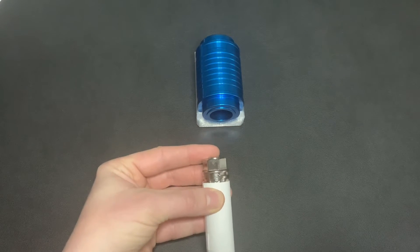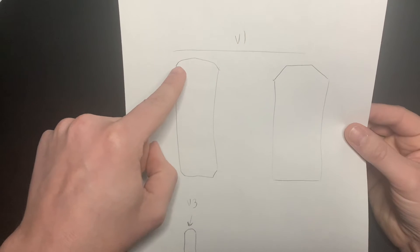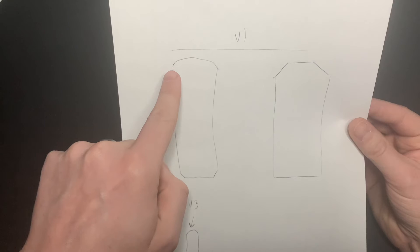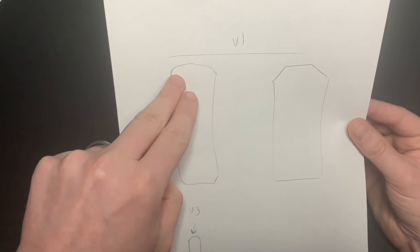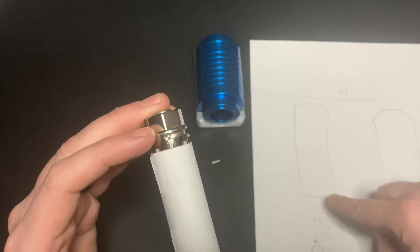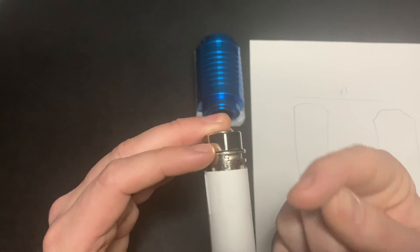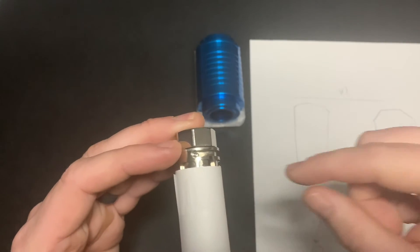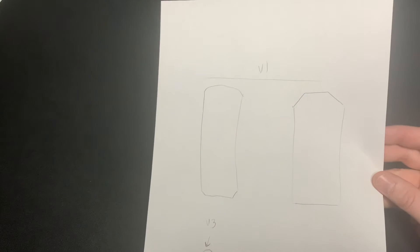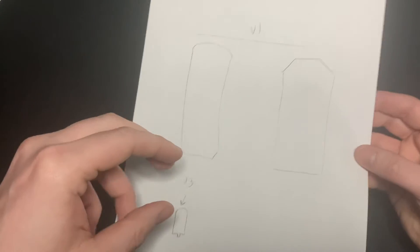Something unique about these pins — I have a quick sketch here, kind of rough. There are two pins. The pin on the left is typically for the maze: it has a rounded end and a slightly chamfered end. A chamfered end is when it's cut at 45 degrees. The rounded end is the one contacting the maze. Looking back at our actual pins, the slightly chamfered end is the one sticking up, because when you put it back in the sleeve, this part goes inside touching the spring assembly. So the rounded end is actually down — that's the part contacting the maze.